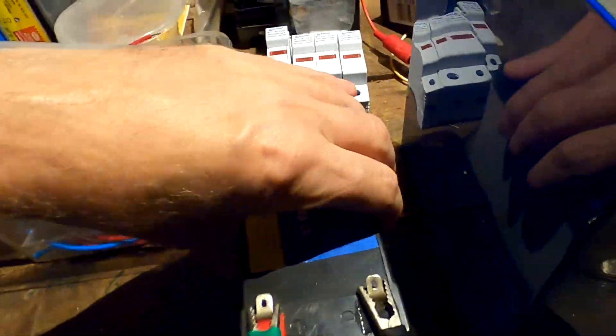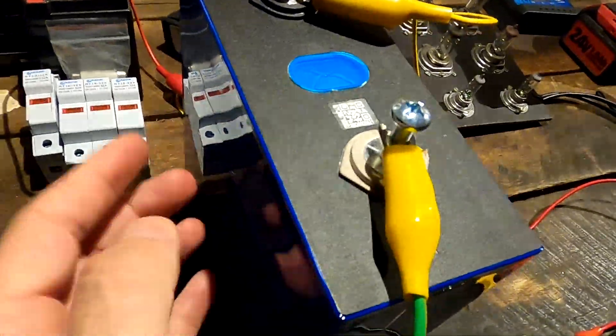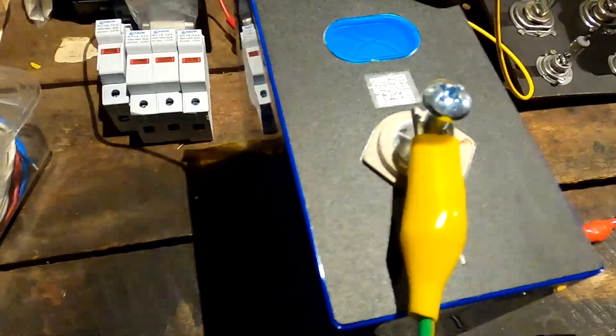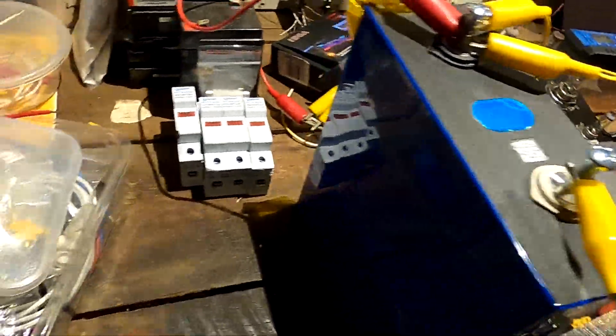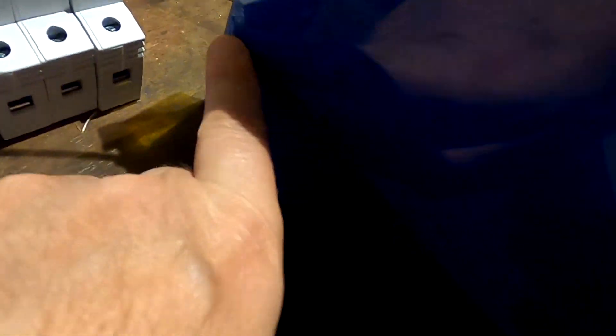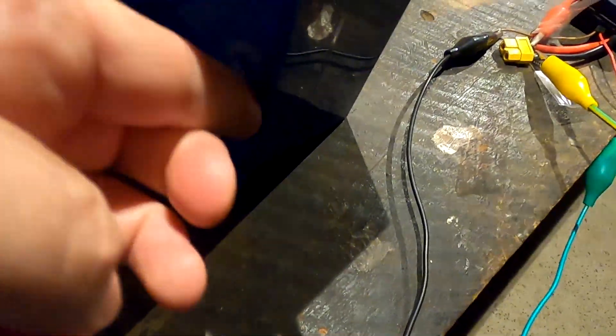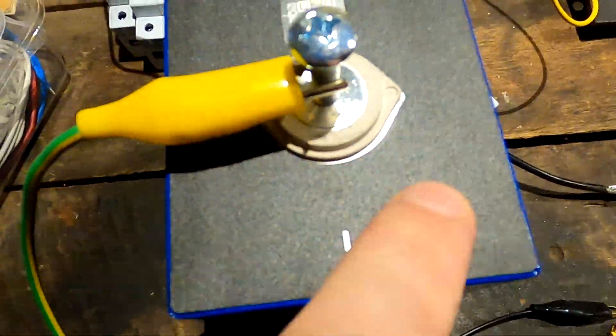I picked a cell that is a bit damaged. One of you said to be careful buying from China because sometimes they repack used battery cells — put new heat shrink and a new black sticker on top, clean everything up, and sell them as new. I'm not expecting that with these ones; they look really good with no scratches. But this one had a little dent and another small dent, and there's a black mark on the negative terminal. So maybe this is one of the repacked batteries — I don't know. That's why I picked this battery: if something is wrong, we will see it in the capacity test.